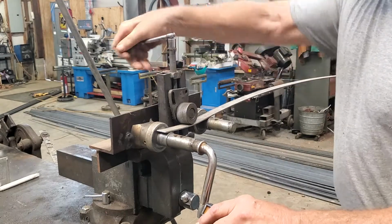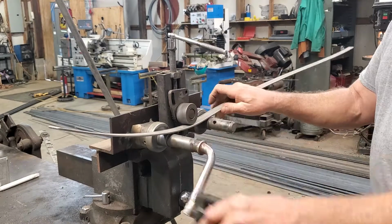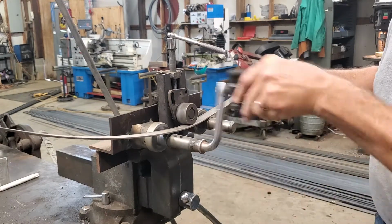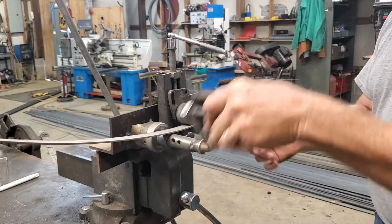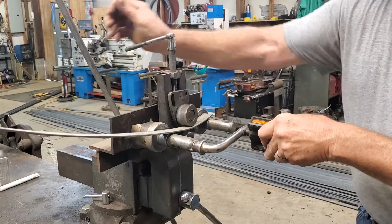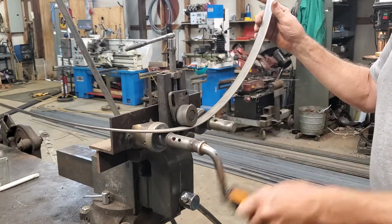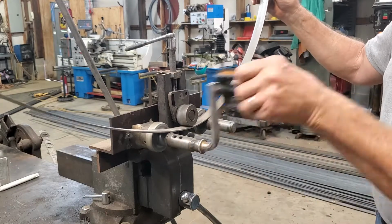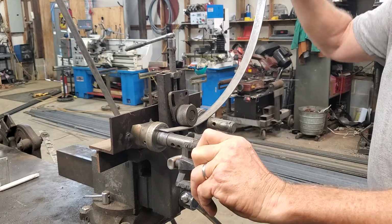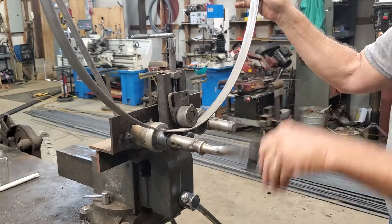And you crank this down, bicycle pedal for a crank. Look at this. Now, this is a really smooth roller. Sometimes I actually push it through just to speed it, but there's about one crank or so, and you can see it's rolling a nice ring. Bring that about one more, and I think we're about there on this.